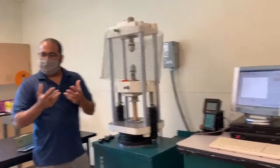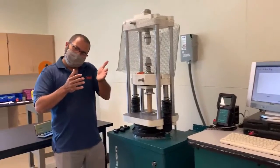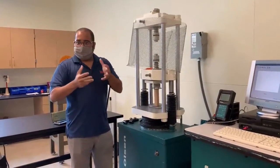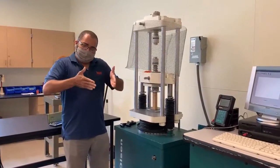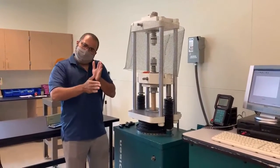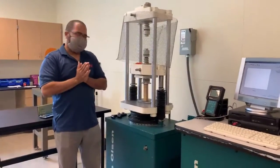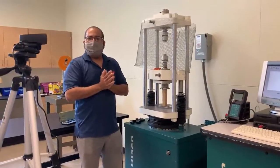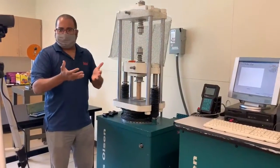You can also have shear of your specimen, where you have a crack going across the grains, so that's shearing of your specimen. And you can also have splitting of your specimen, where you have the crack probably running almost along the grains of the specimen, right? And the last one, the fifth one, would be a combination of shear and split, all right?